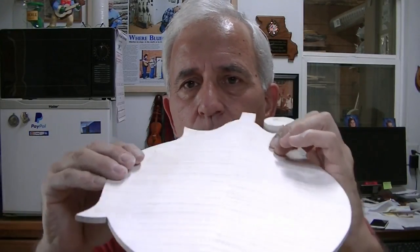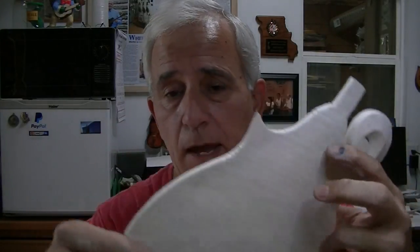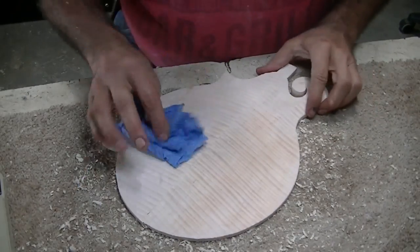I've spent another hour or so sanding with 220 sandpaper, really trying to get all the little imperfections out of the outside of the back. I never touch the inside with sandpaper. The traditionalists will even say they would never touch the outside with sandpaper — they only use a scraper. But I'm good enough to leave the inside just scraped, not good enough to leave the outside just scraped. I've got a lightly damp cloth here; this should make the grain really pop.